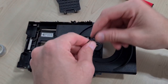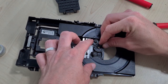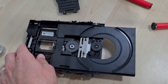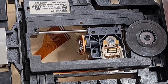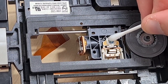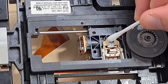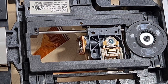Same again — black plastic tabs. It's actually easier to use your hands than a spudger here. This is actually the same part that was on top of the other one, and there's our laser. It's got a fair amount of dust on it but not as much. Identical method from the last one to remove the drive. That belt was actually quite hard with no real flex left in it — separate that out and give this a dust. Same again with the IPA and the rails and the greasing.